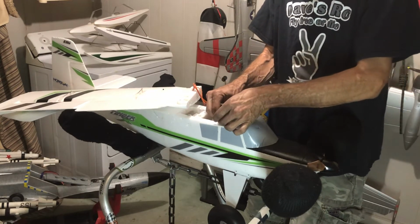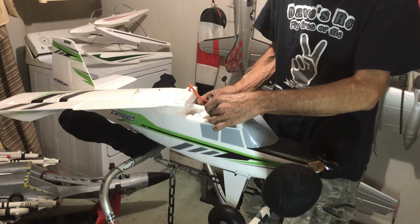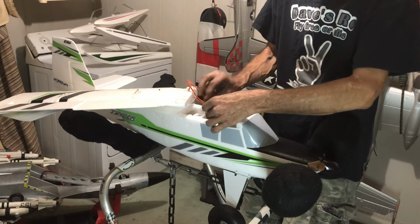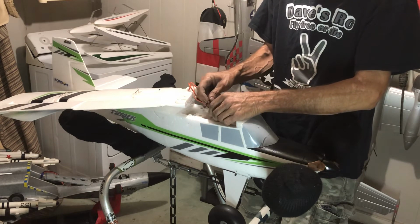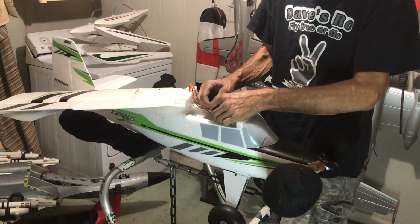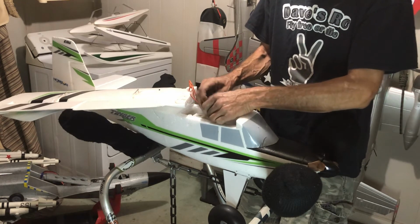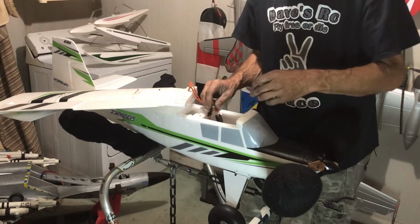Okay. L1. That's what I'm looking for. Nope. L2. Checking our polarity on those LEDs. It don't give you a second chance on that. Rechecking my polarity just to make sure that I don't have no smoke for that.